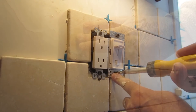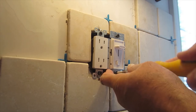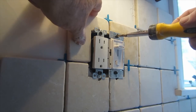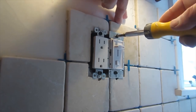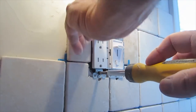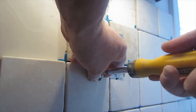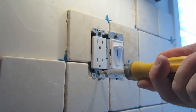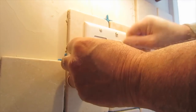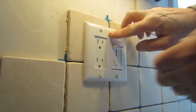I'm going to tighten these screws down just a little bit — I'm not going to really tighten them down too much, just to hold everything in place. You don't want to really crank them down at this point. You'll tighten them up the next day when everything is set — that's when you're going to really tighten them down. I don't want anyone to say anything about drywall screws that are in here instead of the mechanical screws — they were already there when I got on this job. And that's the faceplate on top and everything's covered. That's what it should look like.